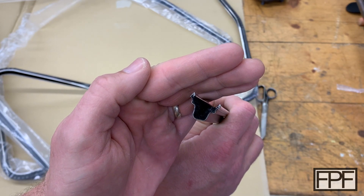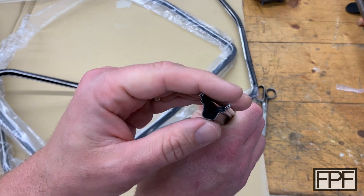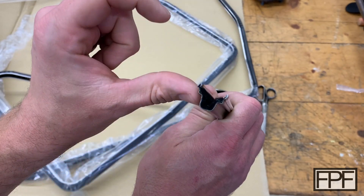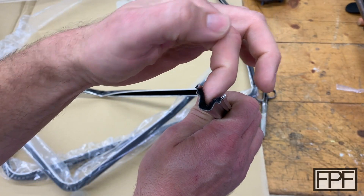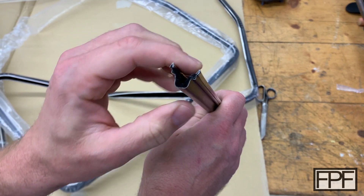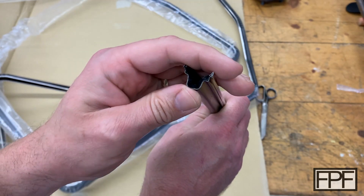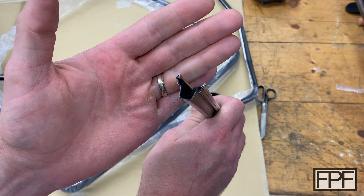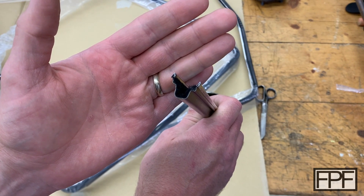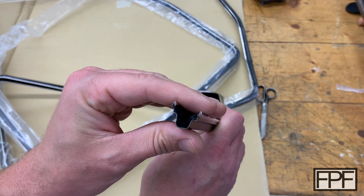I was thinking: what if we made a two-part die in PLA that was this shape — a piece would fit on the outside and a piece would press in from this direction, and we could either use a clamp or a hammer or maybe even a press to try and get this sheet metal back into shape. So let's give it a shot. I'm not going to show trying to measure this. I'm just going to take this up to my desk and measure it as I do the drawing.